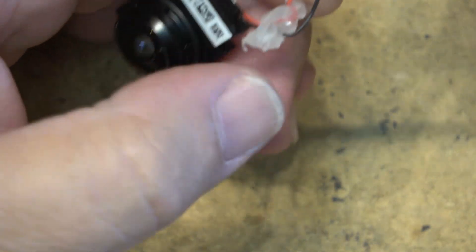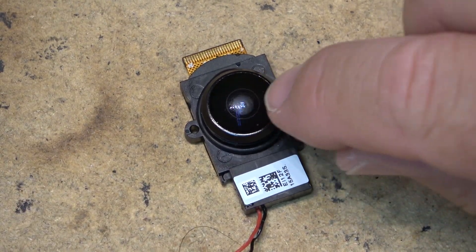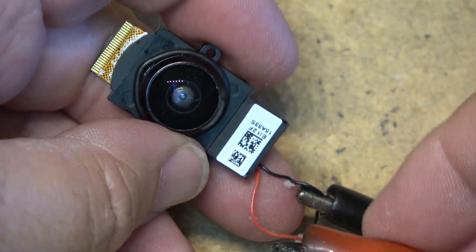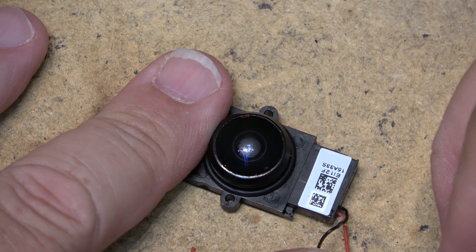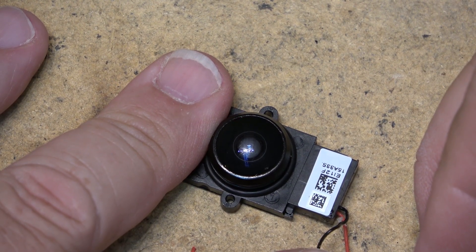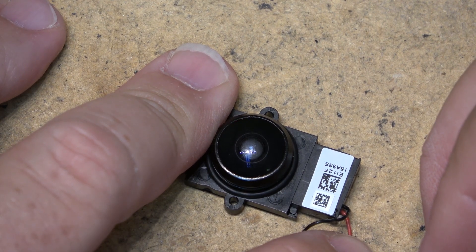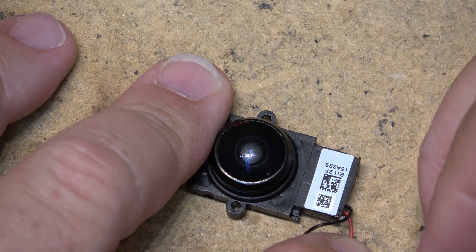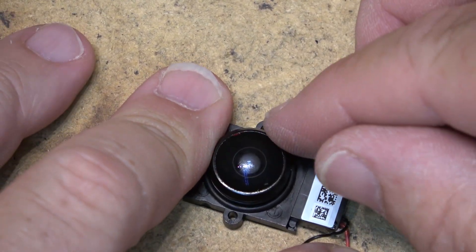What I'm curious about is if I put a little bit of voltage onto these wires, will we see a physical shift? We should be able to see a filter move in the lens, between the pickup and the sensor. I'm seeing about 200 to 240 milliamps. I don't see anything attempting to move — there should be a click and this should actually shift the filter back and forth. I can hear it clicking but I don't see the filter moving, and it should move.